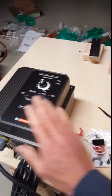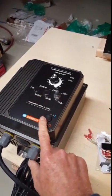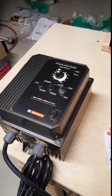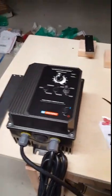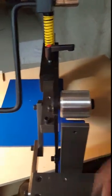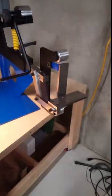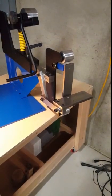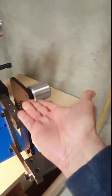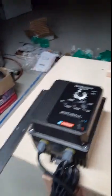There are two basic schools of thought here. Pretty much all the grinders that people buy come with optional switches not typically included for reverse — I suspect that's for safety, since it's obviously dangerous to go in reverse with a system like this that would throw things up in your face. But I'm going to be using the reverse setting specifically for sharpening blades at a very slow speed, and I'll have the platen tilted up a bit on its axis so it's not coming straight up at me.